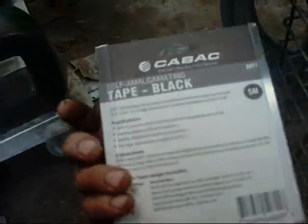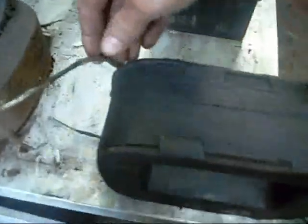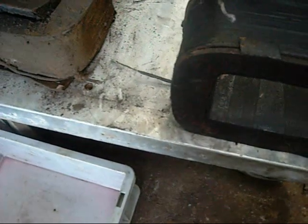Back to these again. I did some shopping this morning and got some self-amalgamating tape, which is sort of like this tar tape — just wrap it up tight, stretch it and wrap it, and it just fuses together into one mass. Perfect for insulation in very hostile environments, so that's the modern equivalent of our lagging tape. I also got adhesive-lined heat shrink to try and reinstate some of these wires, because once you start breaking this apart to fix it you just unleash all sorts of hell. So that's going to be taped back after it's been heat shrunk.